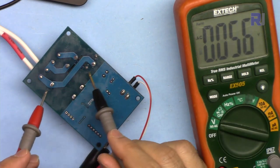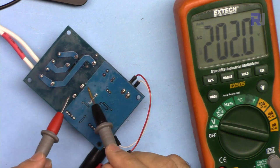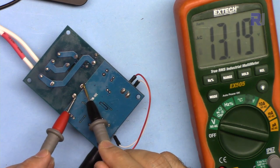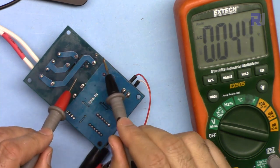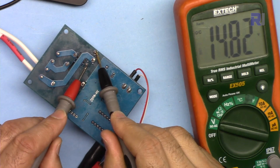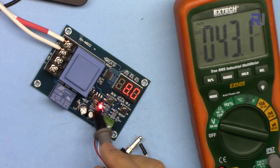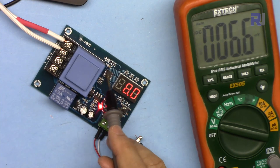This is the primary of the transformer: these two pins accept 240V AC input and the two output pins give AC at 13.3 volts. The other two pins are DC pins for the relay - as you can see the relay is receiving 14.8 volts when on. This voltage goes to the AMS1117 regulator which converts it to 5 volts for the rest of the circuit.